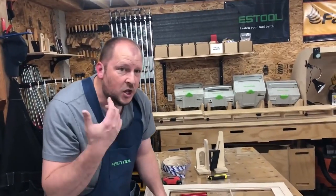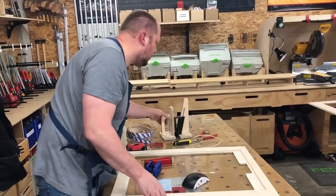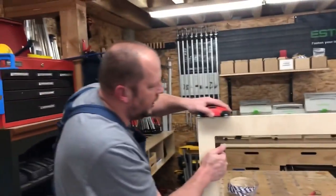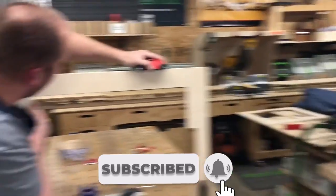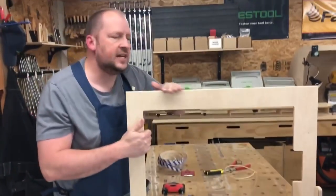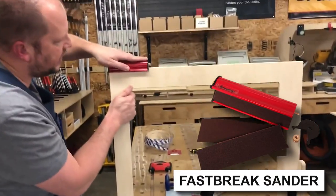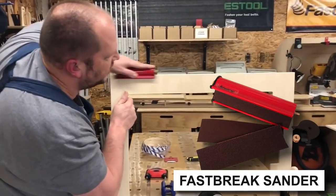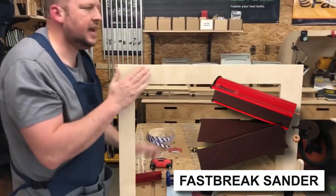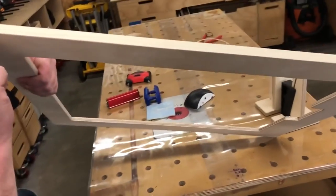Really easy — don't overthink it, just practice. Before I do any more work, I'm going to put more pressure on it: one, two, three, maybe four passes. You want nice pressure because that activates the adhesive. Now I've got the edge break tool here — I'll just go across, one two three. The edge is broken, and what you have — except for the dust — is a perfect edge banding job, and you can do it every time.